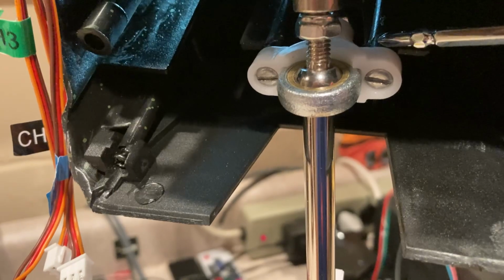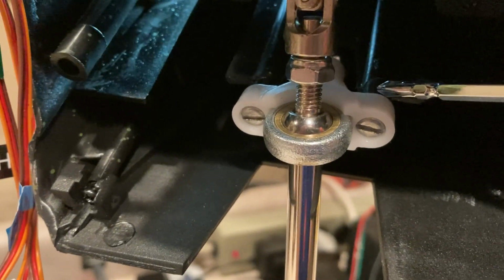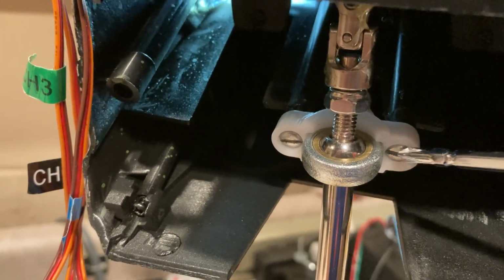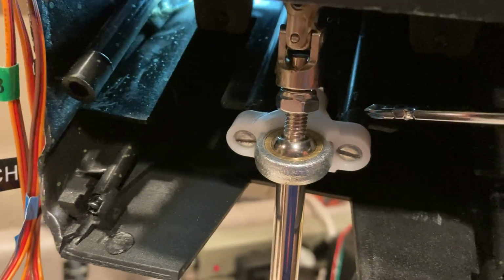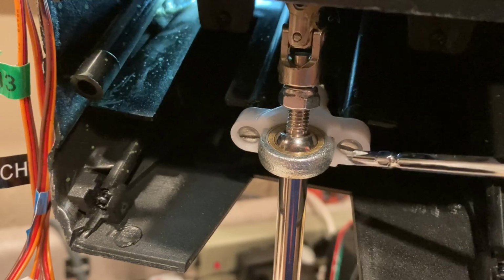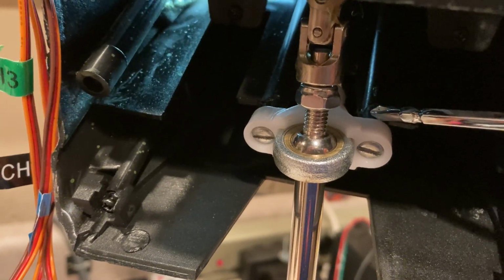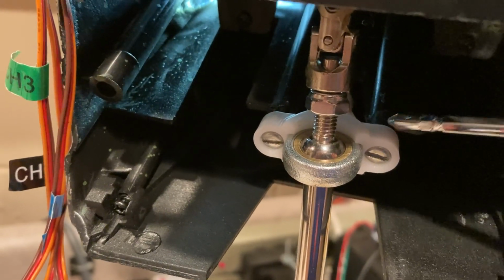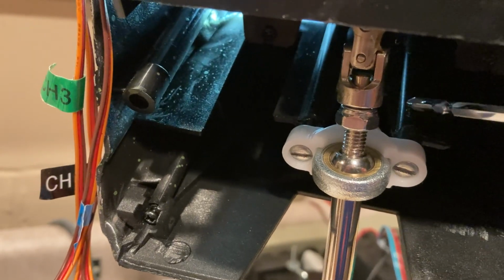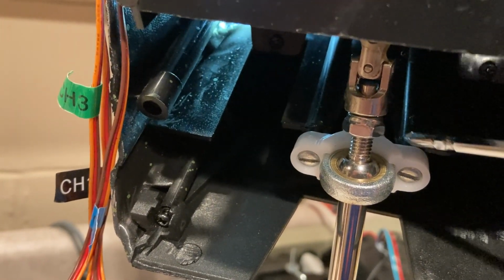The only reason I did take a little glue and put it on here was just to hold those caps that broke off in place until I got the screws started. But like I said, I drilled the holes bigger in the 2 pieces that broke off, because I wanted the screw to pass right on through that part. I didn't want it to screw into it, because the stress would have totally ripped it, even the glue, off there. So it went past this point, and then I screwed into about right here. Those screws actually go into about here, so it's got plenty.